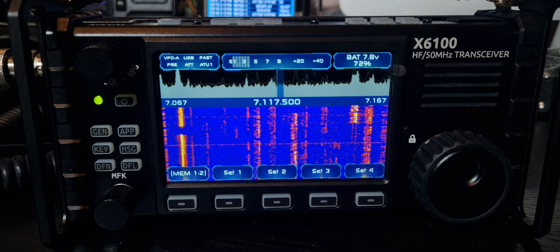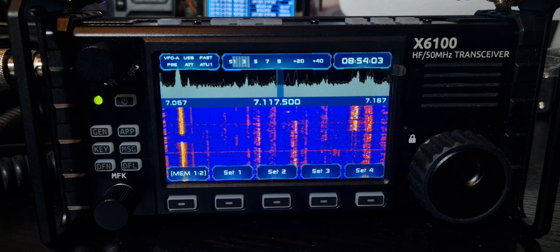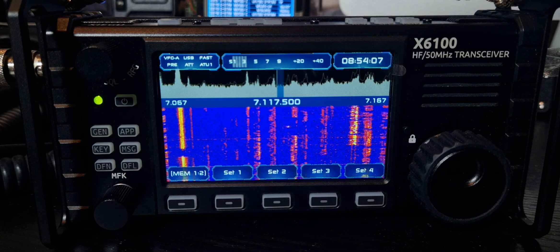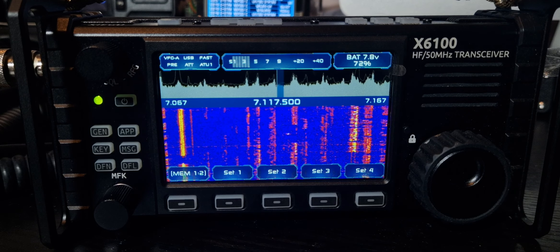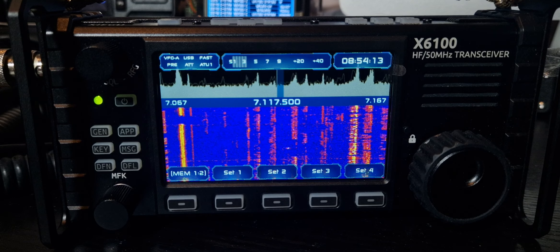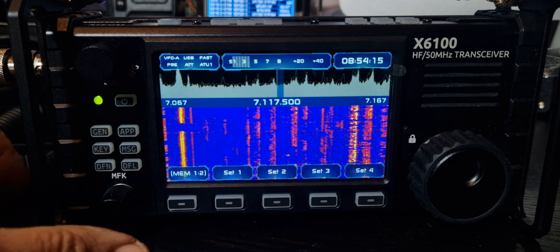According to the download document, this version: volume encoder in dialog windows is a repair; incorrect filter in SWR scan is a repair; added 500 kHz span for SWR scan; memory press-and-hold to load; and the FT8 decoder. Let's go back to that — that was fun.